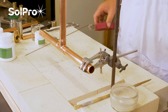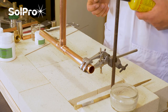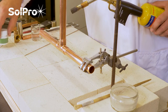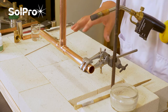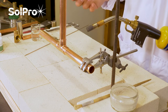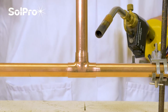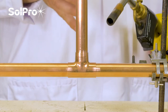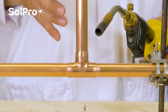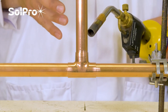We're going to try this with a plumber's torch - just a propane torch - to do three joints on fairly big lumps of copper like this. We're probably asking a bit too much of it. This is more likely to be an application in an industrial environment for air conditioning or heating engineers, who would potentially have a little oxy-acetylene bottle which gives a lot more heat. But we're going to try this just to show you that it can be done and prove that if we get the heat in the right place and at the right point, we can braze all the joints together.